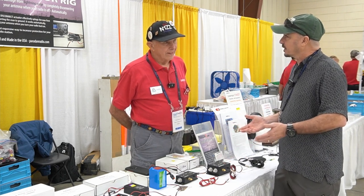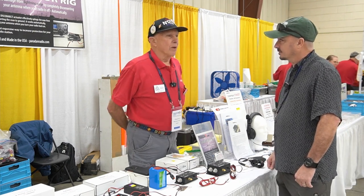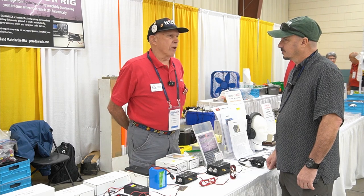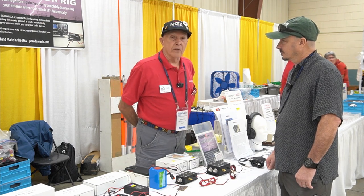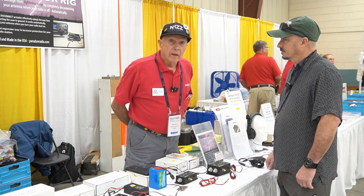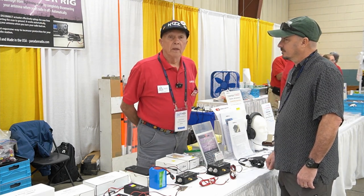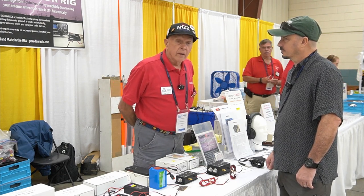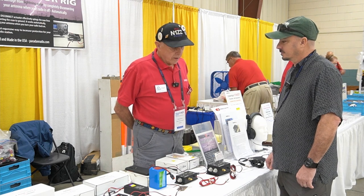What in the world is an antenna disconnector and why do I need one? Well, everyone should have an antenna disconnector if you live in an area where there's lightning strikes and static — rain static, clouds coming overhead discharging, and even snow static. An antenna disconnector keeps your antenna disconnected from your radio and grounded, so that any lightning surges that come to your antenna system through induction from a nearby lightning strike or rain static get shorted to ground and kept off the radio.